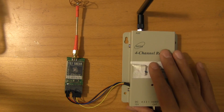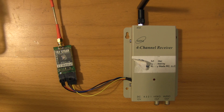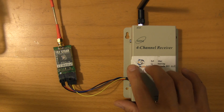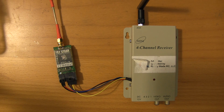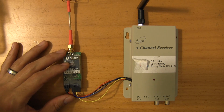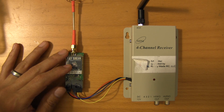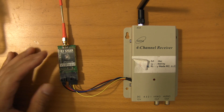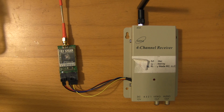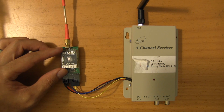This component over here on the right you might recognize. This is the four-channel US version of the 1258-1280 MHz receiver sold by ReadyMadeRC. And then on the left-hand side is just a simple 250 milliwatt transmitter. This is a little overkill for what I'm doing, but it's what I had on hand. Vendors like dpcav.com as well as ReadyMadeRC sell micro versions of these transmitters that are just 25 milliwatts.